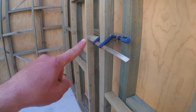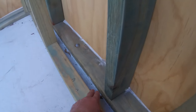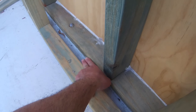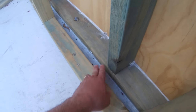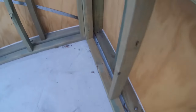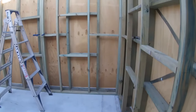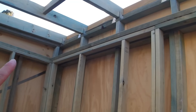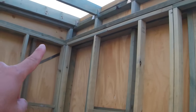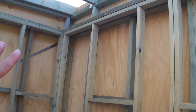All of the roof battens are done, so the roof framing is now complete. I have also temporarily clamped my internal wall to see how it actually fits. You can see there's a gap about the size of two fingers, which is about 20 millimetres or two centimetres apart, and that goes all around.